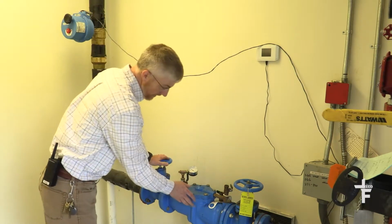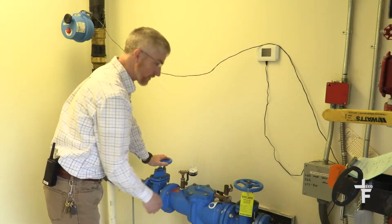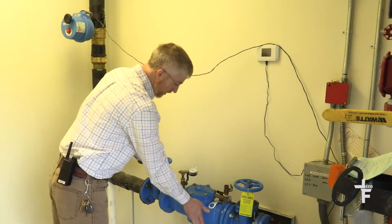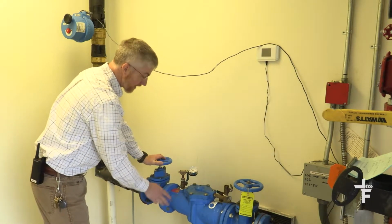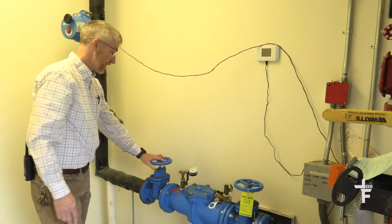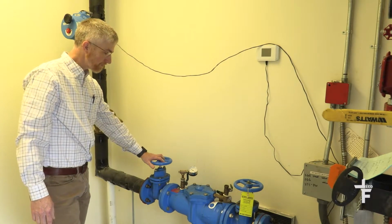So there's two check valves in here. Because the flow is going this direction, the way people talk about this is this would be the number one stop and the number one check valve, and you have an arrow here. The number two check valve, the relief valve, which vents to this pin, and then the number two shutoff valve.